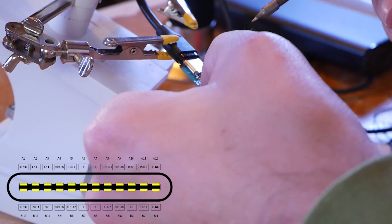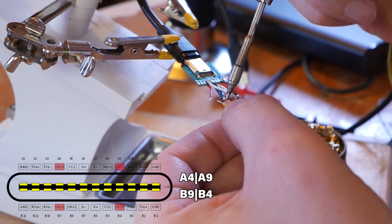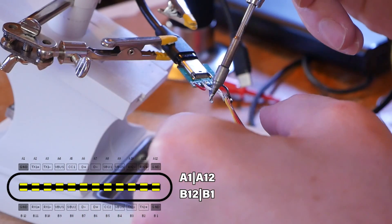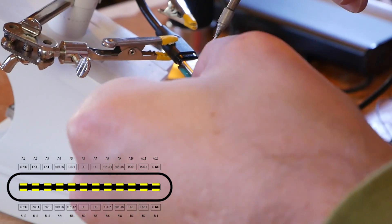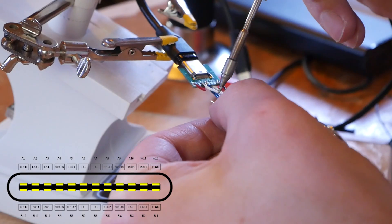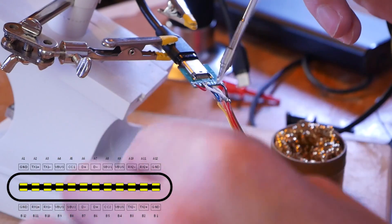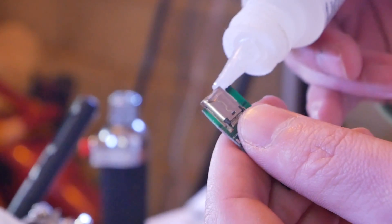You'll need 12 short wires to wire your USB Type-C. We're going to start with VCC, which is marked on screen. Then there are 4 wires for ground as well. Because the connection is reversible, we have to duplicate those. Then we have the data pins — D- and D+ — also 2 cables each. Solder these cables together and then connect them with the wires coming out from the PCB itself. This is how you connect double cables to a single strand coming from your PCB.